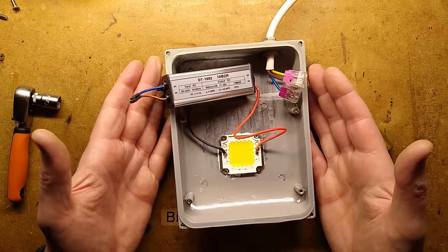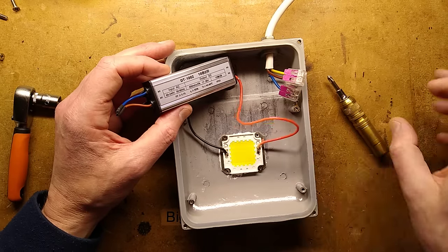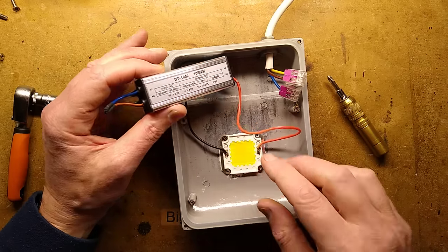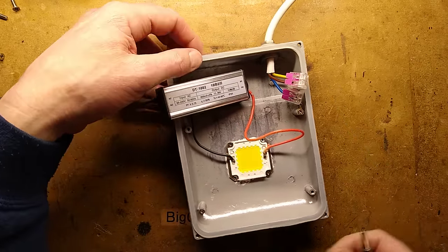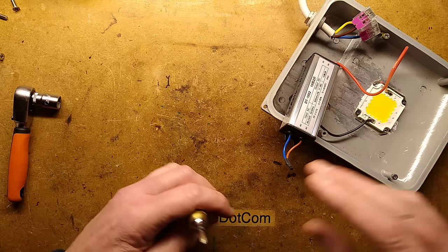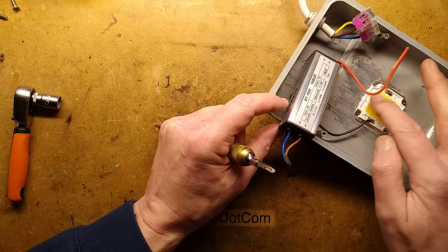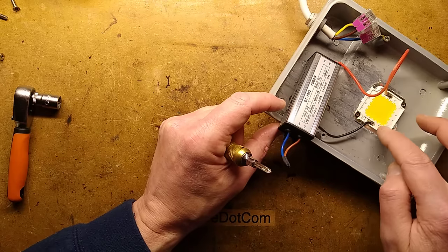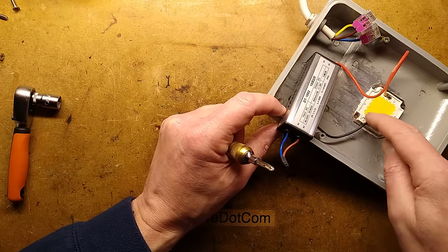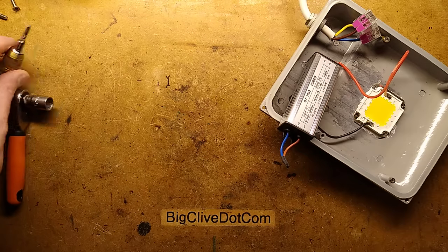This is a light I've had for a long time, but I've retrofitted it on more than one occasion over the last 10 years with new LEDs. The LED in here is a high-CRI LED, rated 50 watts, but I'm running it from a 20-watt power supply. I have a new 20-watt power supply to install because the intermittent blinking is most likely caused by the power supply. The LED has 4–5 series strings, and when the bonds fail — as they do — strips go out but not the whole lot, which hints at dying capacitors.